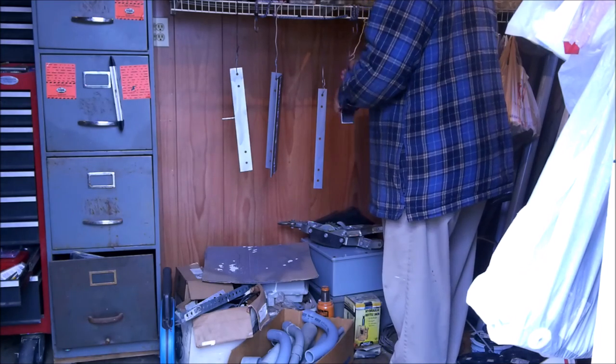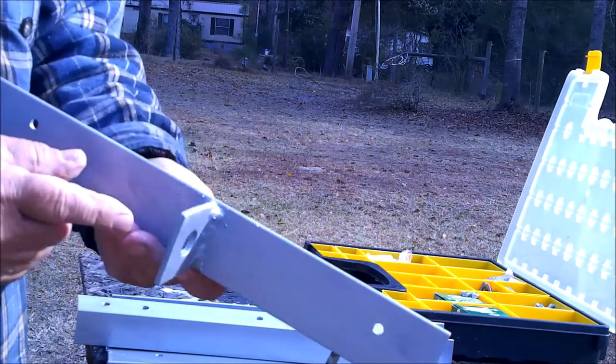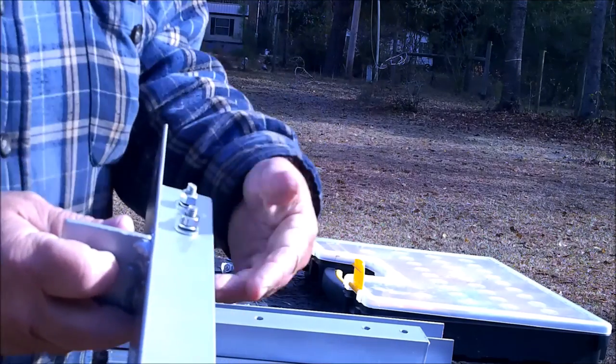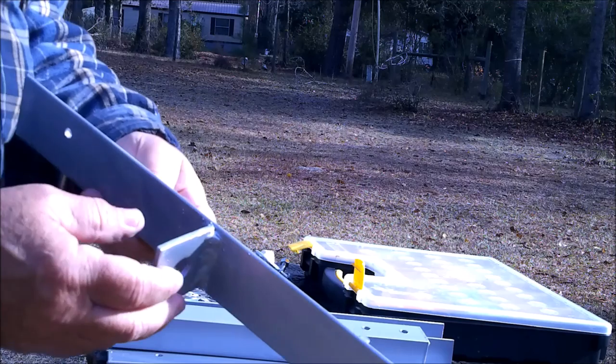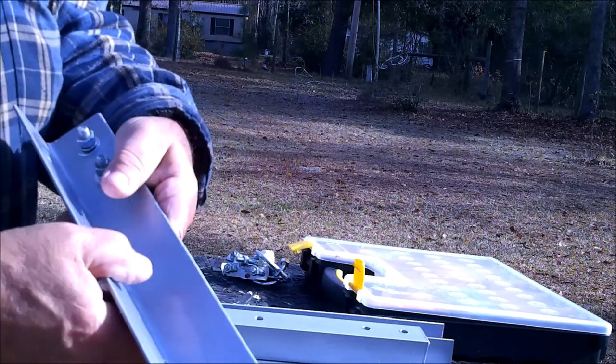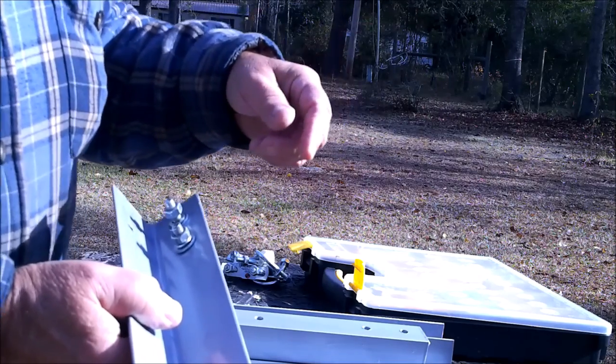What I'm going to show today is the brackets to hold the electric winch and the brackets to keep the bottom of the tower from twisting, to the stationary piece of the tower. This piece that I welded on here is so the cable for the winch will hook on here, and this will transfer the stress to this bracket to both legs right at the point where there are some triangular, I call them gussets. You'll see.